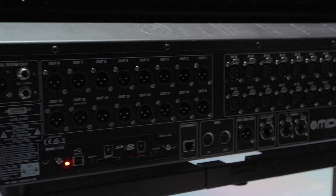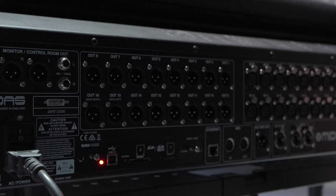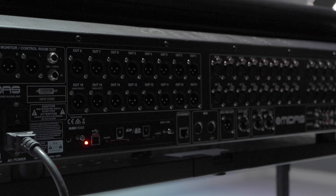You've also got 16 outputs. These are also XLR outs, and they've designated out 15 and 16 as your main left and main right output. That said, you can use any outputs you want because the routing is internal — it's digital. You can route this any way you want. I used to work in a venue with many different rooms, so having stereo outputs for all those rooms is super key — main front of house, subwoofers, back room, outside, et cetera.